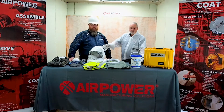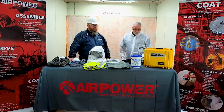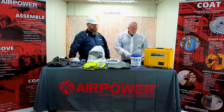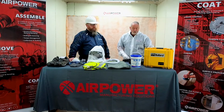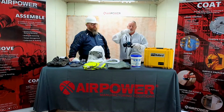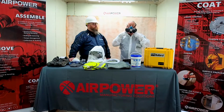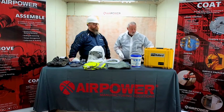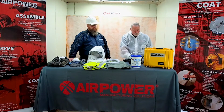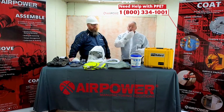So when we come off of the dust respirator, we can come into an organic respirator that people are used to, that spray liquids use to protect themselves with solvents and VOCs. You put this on, you snap it in. One of the issues people run into is that if you have a beard like Travis does, it's not going to seal.